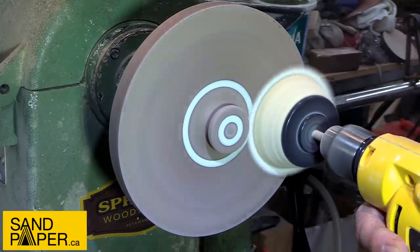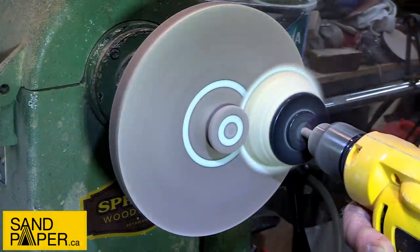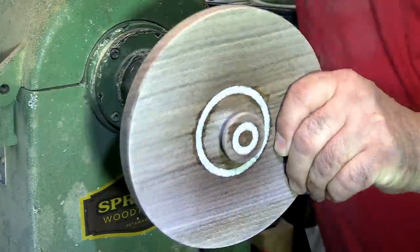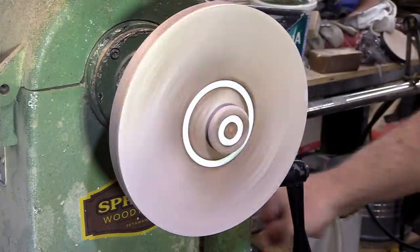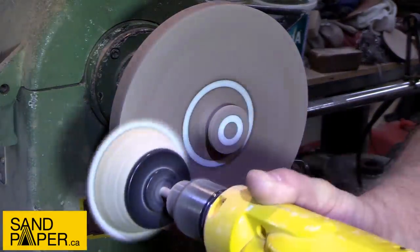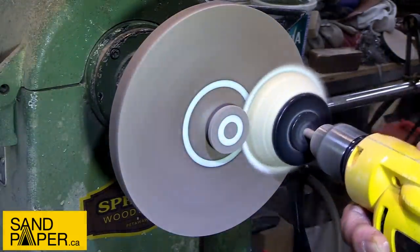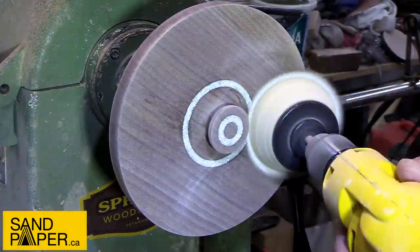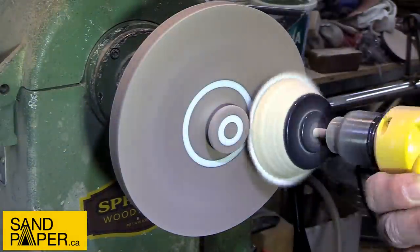This was sanded from 60 to 180, then I checked to see if there was any filling that needed to be done — and sure enough there was. So from here on it's 180 to 320, and you'll see me stop the lathe at some point to do some spot sanding, then blend it all in and we'll be able to move on to the next thing.